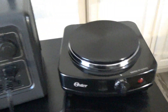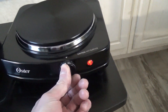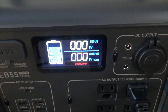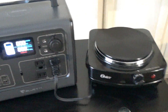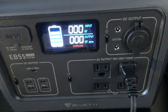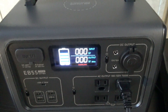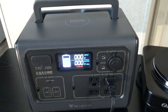This is a 700-watt inverter and this hot plate should pull a little bit more than that, but maybe they underrated it slightly — let's just see. The fans on the Bluetti do come on, and we're reading 800 watts. Now we're getting the overload warning, and it just shut off. That's what I expected. It confirms that this inverter is awkward — you'll probably just be running small loads off it, and you'd be better off with a unit that has a smaller, more efficient inverter. Just something to consider — hopefully you find this helpful.